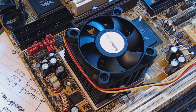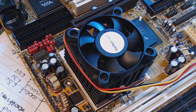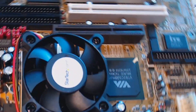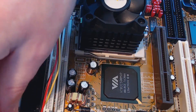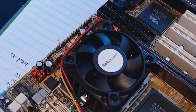We've finished installing the processor. I've used too much paste — no, not enough paste — actually I think I used the right amount. It's a shame I didn't have a proper spreading tool. The heatsink is on and protrudes a little toward the SIMM slots, but that's okay because we're using DIMMs not SIMMs. As long as the wire is out of the way of the fan and we're getting airflow across the board, we'll be fine.